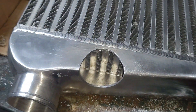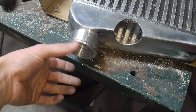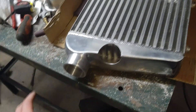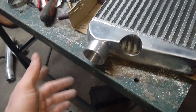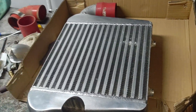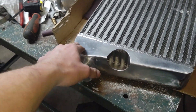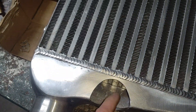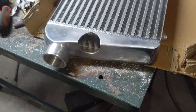That'll work. I've got a piece — two and a half inch solid block — I think I'm just going to throw another coupler on this and plug it off for now for testing. We're going to test it with the pipe with the scoop taped off, and then with this in the scoop. I'll take it back off in a later episode to put the recirculator valve in — I'll have to weld that in on that side. I don't want to put some thin tube in there; I want something at least as thick as this. I'll have to order that, so it'll just be capped for now, but it'll work.